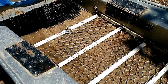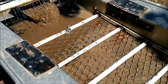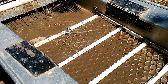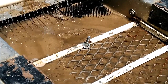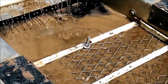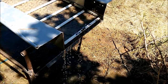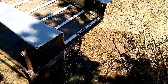If your sluice is running too slow, it will plug up. You don't want your sluice to plug up because then you can't move your material, and if the gold is on top and it's plugged up, it'll wash right out. Another way to tell if you don't have enough water pressure is that there's hardly any water coming over the edge of your sluice.